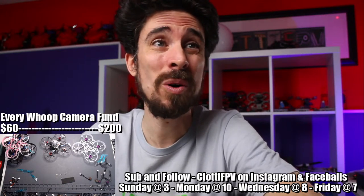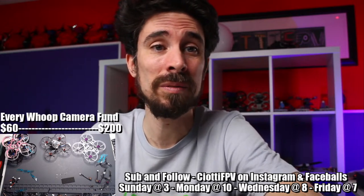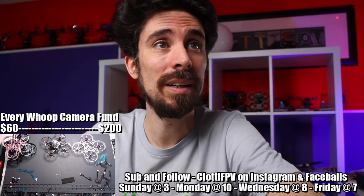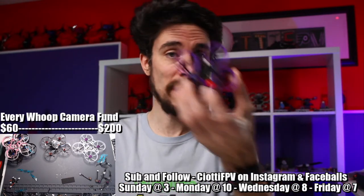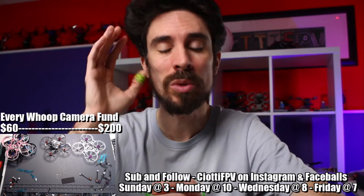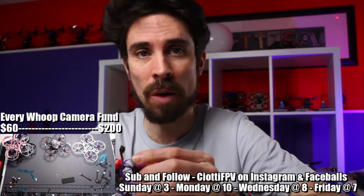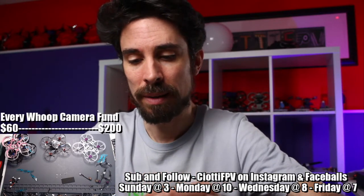I guess the T-Motor is the closest that we've got, but I don't like the T-Motor AIO. There's a bunch of things I don't like about it. If you do get the T-Motor AIO, which I have on this guy actually, make absolutely sure that you backdate it to BlueJay 0.16. It does not work right without it. It falls out of the air and shit.